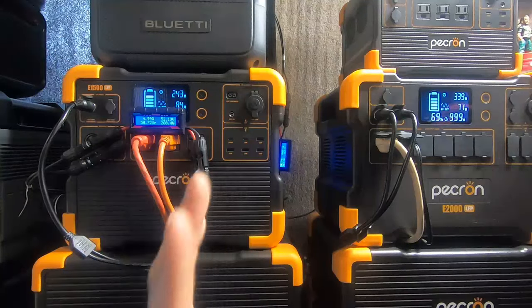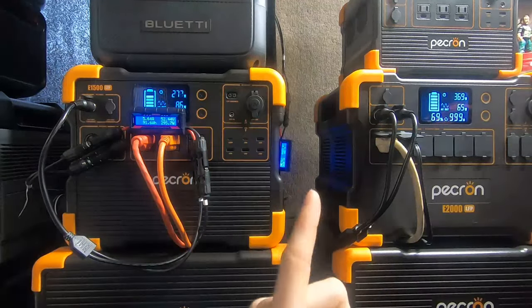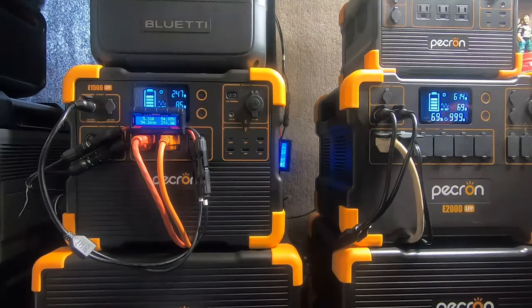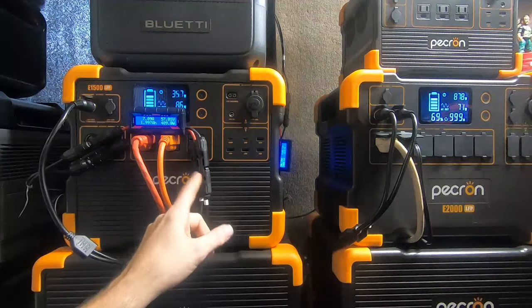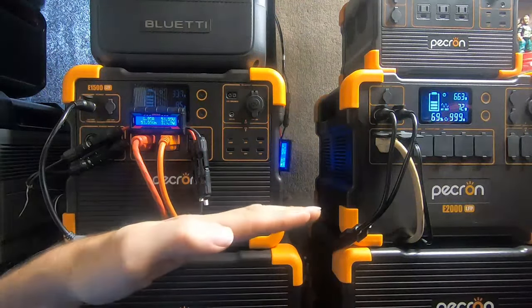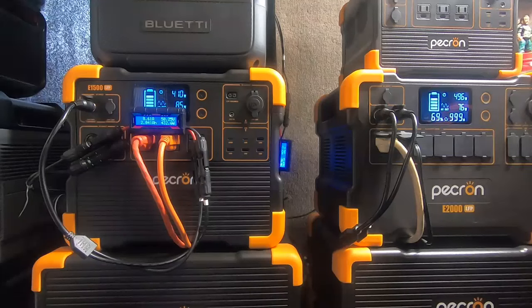Check out these panels even if you just want to try one temporarily. Harbor Freight is local — you don't even have to ship it, just walk in, get one panel, and test it. I think it's the hidden diamond in the rough. If you do the two mods — put MC4 connectors on for a higher IP rating — these are IP67 and can handle rain. The junction box on the back isn't the best, but since it's always facing down, gravity keeps water from getting in.